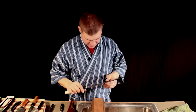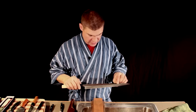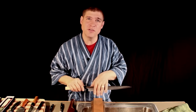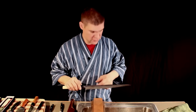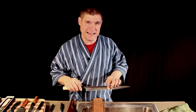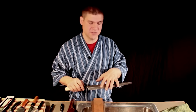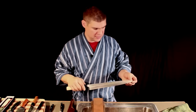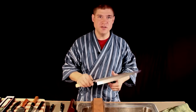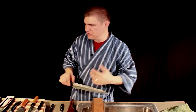But what about these knives? These knives have the original blade thickness. Then they have a bevel that starts here that usually goes all the way down to the final cutting edge. Well, if that's the case, this is the original blade thickness, and the secondary edge is the primary edge, because it goes all the way down to a cutting surface. So that just illuminates some of the confusion about where a secondary, primary, and the blade thickness edges start and stop.